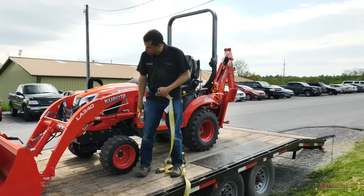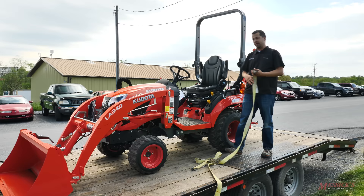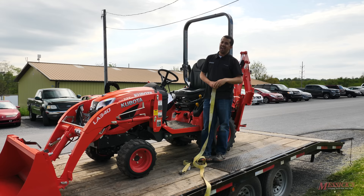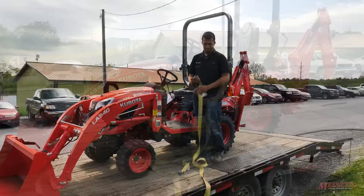Going across the arms and the hood — bad idea. You'll find all kinds of areas back here, say behind your grill guard or over top of your loader torque tube, or around the back of the tractor, that are really good places to put straps. My personal favorite — on every one of our trailers you'll find a clevis. Put that clevis through the hitch itself, through the draw bar in the back, run a chain through that, and that's a great secure place to tie down your load.